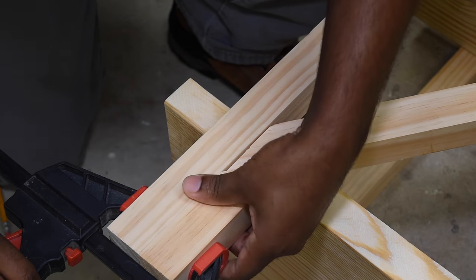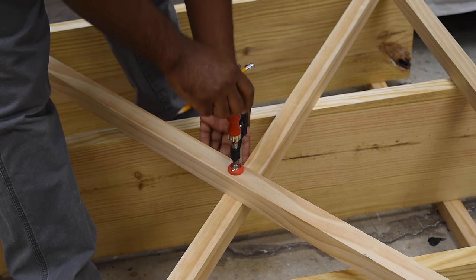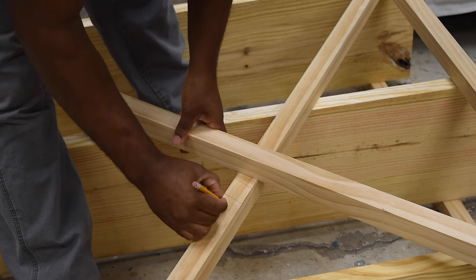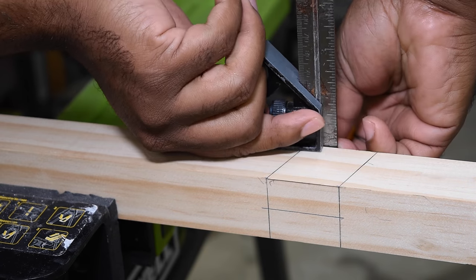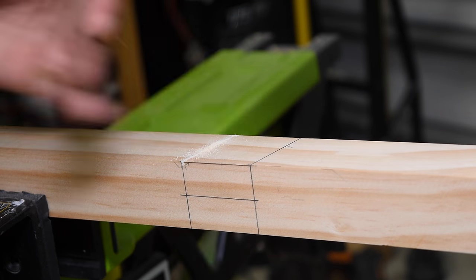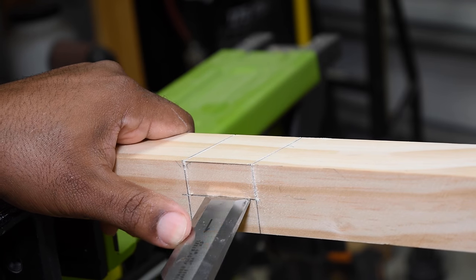For the piece at the bottom I used one of the cut-off ends to hold it in place so it's not moving. I marked the line which established the bottom part of the support, then took a clamp to hold the pieces together and marked them. I also labeled the pieces top and bottom as a mental note to keep track of everything. As a way to fit these together I'm going to use a half lap joint. I marked the halfway point on both supports — the top of one needs to be cut out and the bottom of the other. I used a few hand tools to remove that section and repeated the same thing for the other piece.